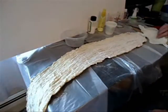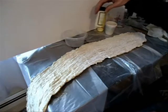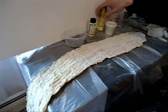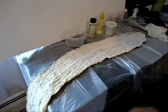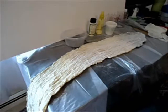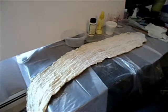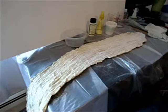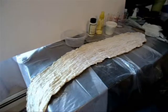I've already used the mold release liquid on here — I filled it in a little spray mister bottle and sprayed it basically all over the mold. I did it once, let it dry, and then did it again a second time because this is the first time I'm using this mold. After all that dried, I used some white spray paint and sprayed over the mold release onto the finished side of the mold.